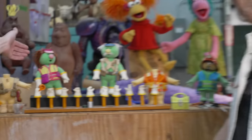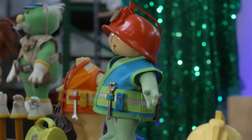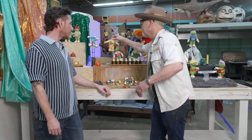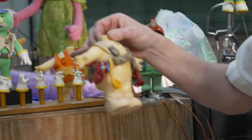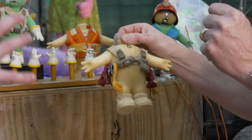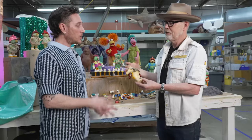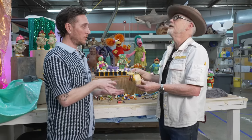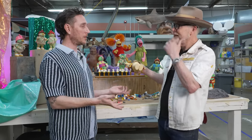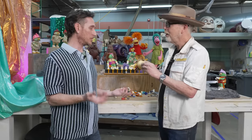Even the heads have full animatronics inside, so you need a very thin skin to accommodate all the mechs inside the head. It used to be that somebody was sculpting every one of these bodies from scratch, then making plaster molds and injecting them with latex. Now that you're using the computer, are you 3D printing the molds? In this case, we 3D printed the body, body-shopped it, and then made a traditional mold of it — a standard plaster mold — because they had to go through the oven process. You have to bake the foam latex in the oven, and at that time we hadn't workshopped molds to go through that process yet.